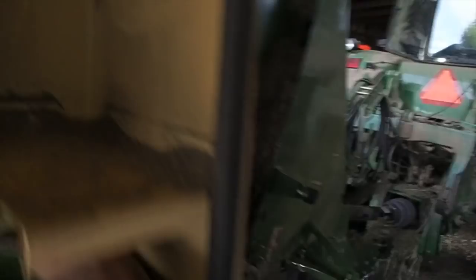I had some issues with this baling twine in this Krone baler. In the New Holland, they had little holes over here and you would pull the twine through that little hole and then it would go up. You had little hangers and little hooks and things. But the Krone is very different - it actually pulls up through the center. There's a little slot here and then it goes up through.